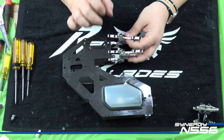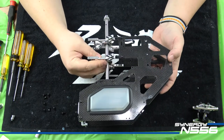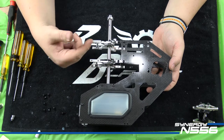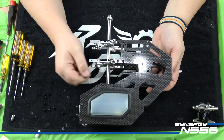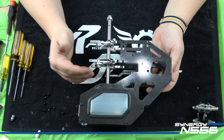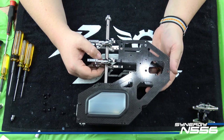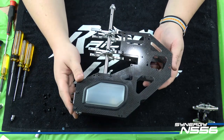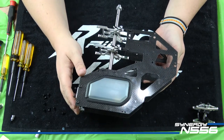I'll cut the camera and loosely attach the three bearing blocks — lightly snugged but no Loctite until I'm ready to finish marrying the frames. As a guide to keep the bearing blocks from getting smashed, I've got the main shaft loosely in here just to keep things lined up while snugging up. There is no Loctite on any of these 12 bolts — just snugged to hold things together. Once I get both frame halves, the engine in, and the main gear in, then I'll go around and Loctite all those bolts.